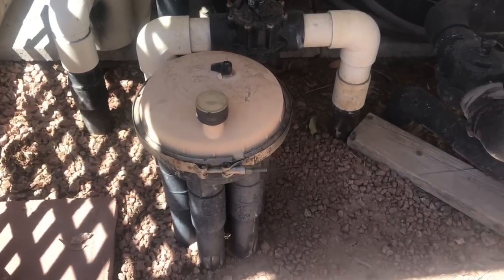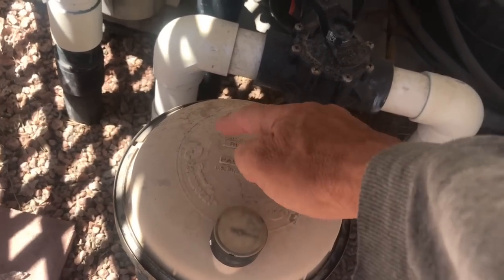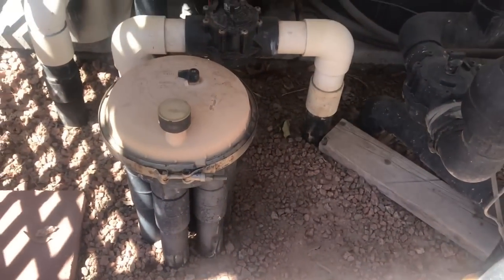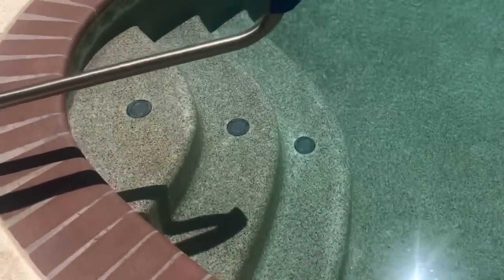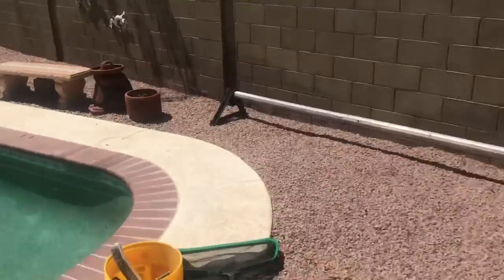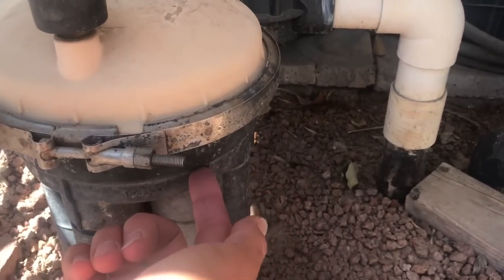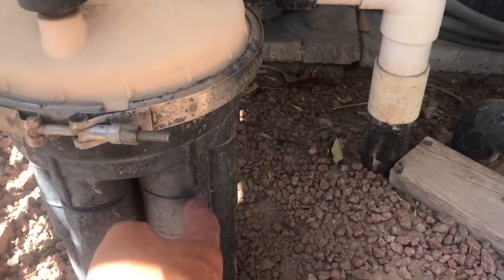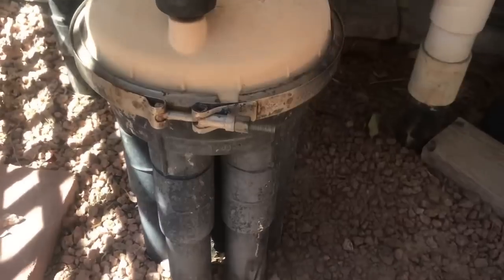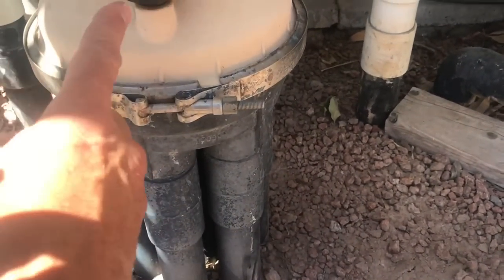Inside this actuator, imagine it like an old-fashioned mechanical clock with a bunch of gears. There's a paddle wheel in here that when the water hits it, it starts to spin, creating pressure. That paddle wheel turns all the cogs and gears, and each pipe at the bottom is tied to a section of pop-ups — for instance, these three pop-ups on the steps are tied to one of those pipes. Inside the actuator is a flap, and as the gears turn, a little wedge lifts the flap, directing flow to each section in sequence.